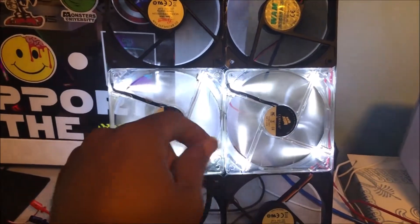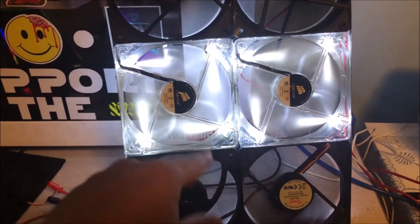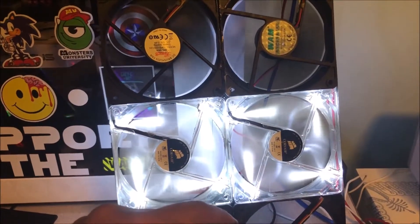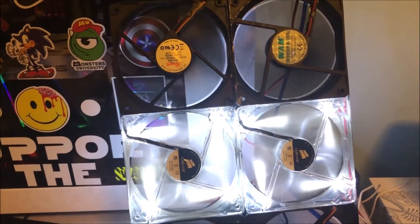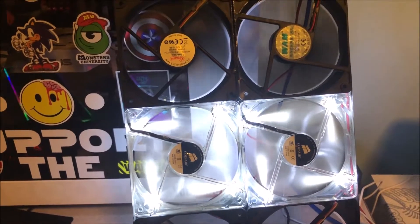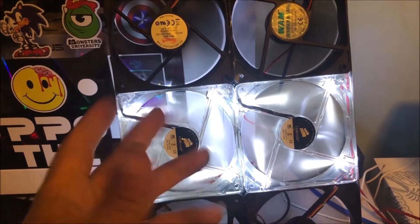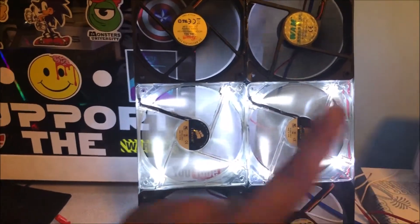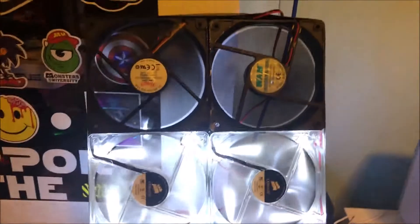On the LED fans, the black and white wire and the middle wire connect together — the black and white wire is for the LED, the middle wire is positive, and the other one is negative. For three-pin fans with yellow, red, and black, use red for positive and black for negative, leave yellow alone. For four-pin fans with green, blue, yellow, and black, use yellow for 12 volt and black for ground. For a regular two-pin, just black and red. Hook all the reds together, all the blacks together, run a longer wire to a power supply — two amps is all it needs.